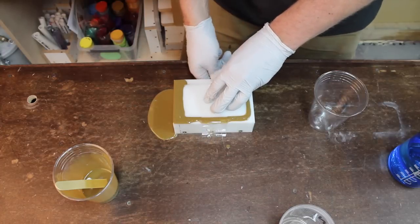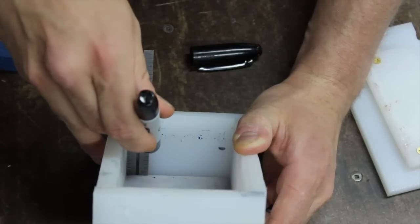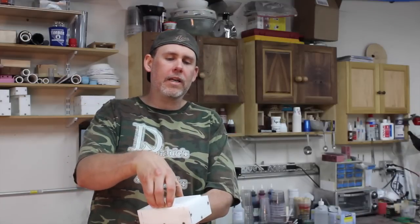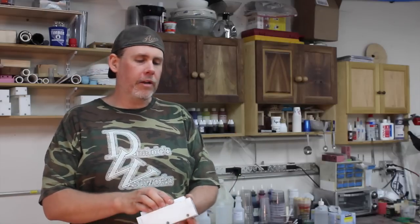But overall, if you're shooting for a 3/4 inch blank, you need to fill the mold with at least 3/4 inch of coffee beans. So that's a good starting point. You might even throw in about 7/8 inch, and just fill that, and then figure out how much resin it's going to take to fill that up, so that you can keep even pressure on the entire casting, but you're not making a gigantic mess. A little overflow doesn't hurt anything. It's not going to cause a problem. Basically, you can just clean up any spilled resin with acetone.